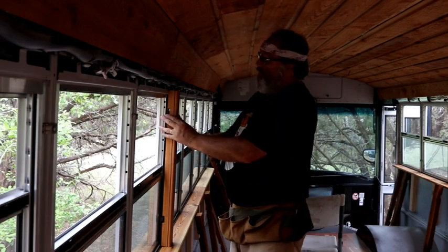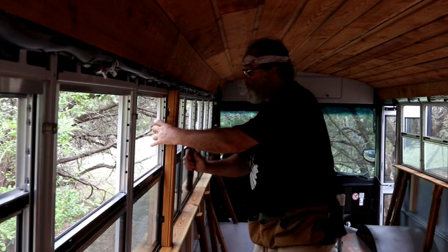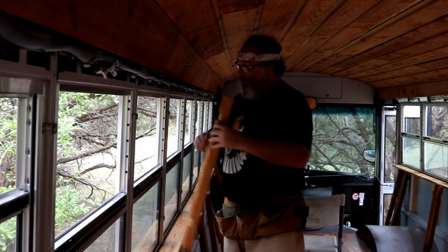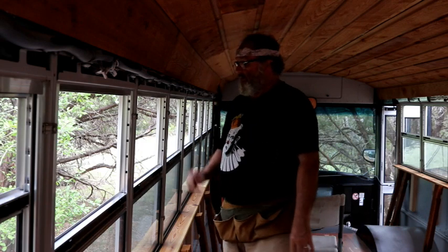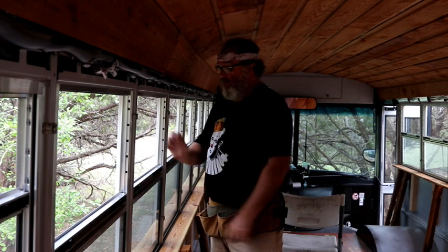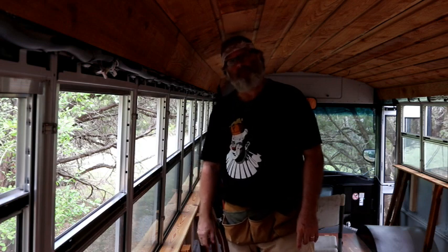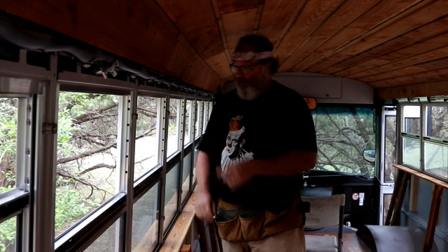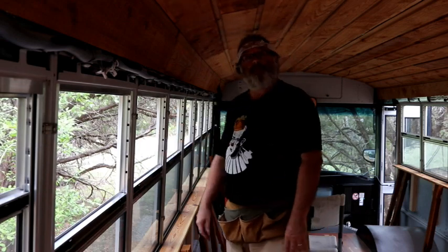And the way to place these is put the screw in, tap, tap, tap, tap. That marks the spot. And I'll bring a hardened titanium bit, pre-drill the holes into this steel post, and then the self-drilling screws will cut and then drill and then just pull straight in. And that's how these are going to be. Only 28 of them to do.